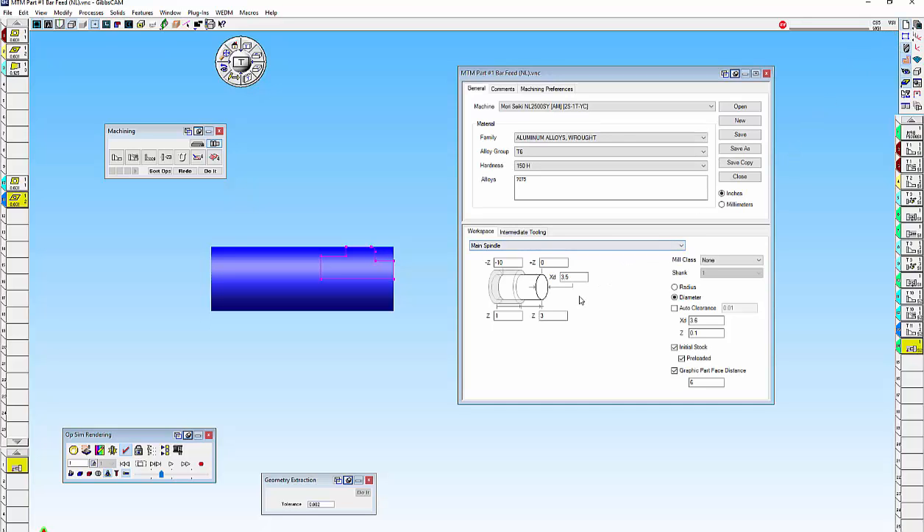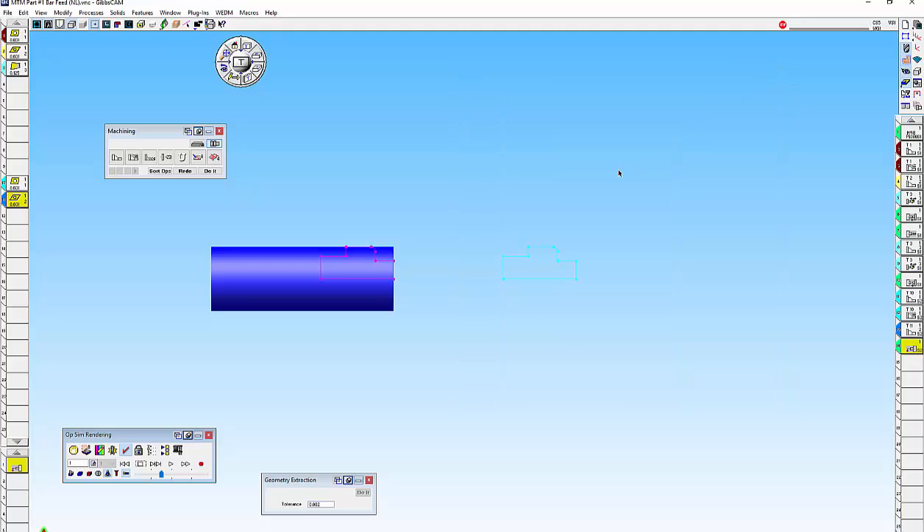That's all you need to do for MTM — a quick little demo. Don't forget your main spindle and sub spindle clearances need to match. A couple other variations: you can start out with a part in both the sub spindle and main spindle, which is sometimes faster if you want to use the roughing tool to rough the main spindle and then rough the sub spindle before changing tools. So depending on what kind of part you're doing, sometimes that's advantageous. Thanks for watching.